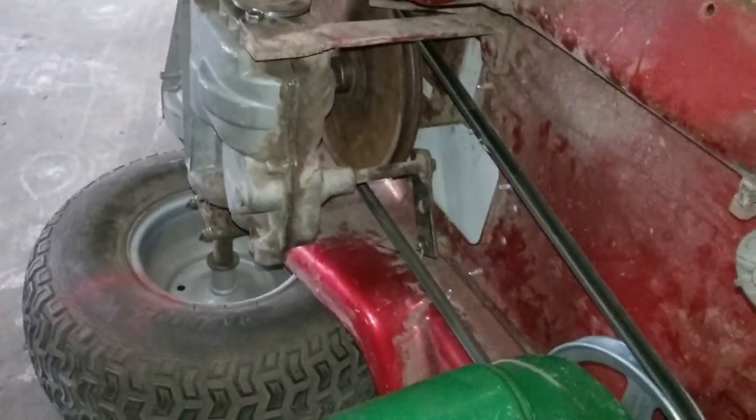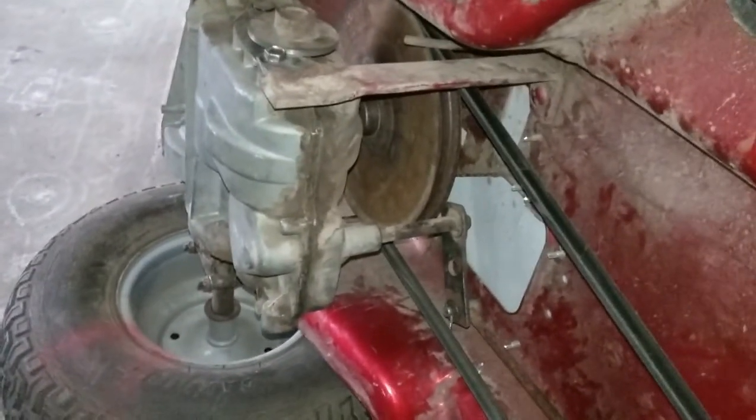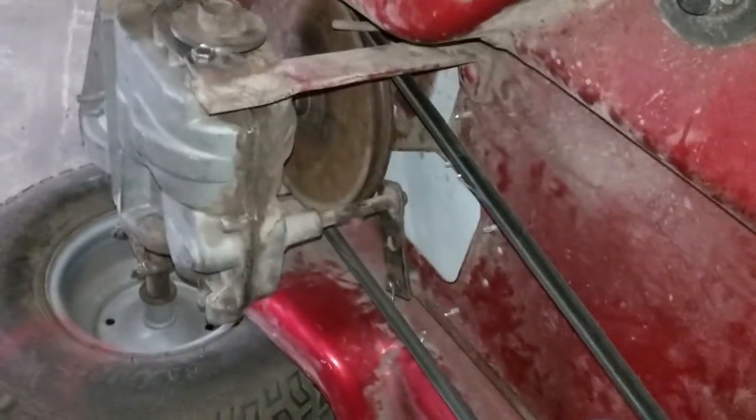The pulley didn't work on the old one as well, so I got a different pulley on this one. I'd like to put a smaller pulley back there, but with the kids driving it they probably won't be able to go over first or second, maybe third gear with a small pulley. That was like an eight or nine inch, and I'm thinking about putting a five or six inch on there - I've got a six inch here and a five inch there.